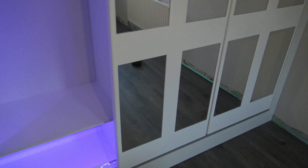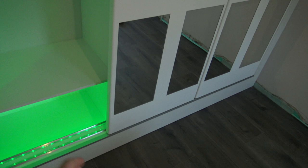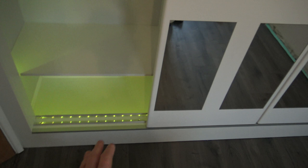These doors are used, as I mentioned, because they were given to me, but also they're much more rigid than MDF or anything like that, or even chipwood for doors. The surround there allows me to use these doors. The doors are now going to reach from the floor to the top of the roof. So the surround's doing two things here. It's compensating for the uneven or unlevel floor, and it is also allowing me to use these doors.